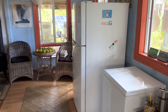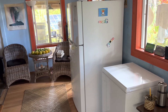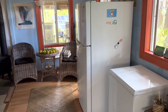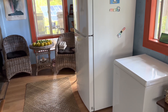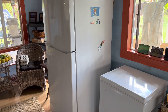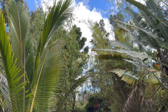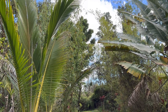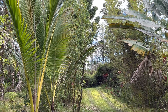The biggest difference lithium iron phosphate has made to the off-grid lifestyle is being able to run more modern appliances — refrigerator, freezer, an extra freezer for food security. It's kind of a no-brainer with today's prices. The longevity is remarkable too: if you take care of them, these batteries will last for so many years beyond what lead acid could do, without the fuss or maintenance. Combined with Victron charge controllers, these systems are basically plug and play — once you get it configured, everything just works perfectly.